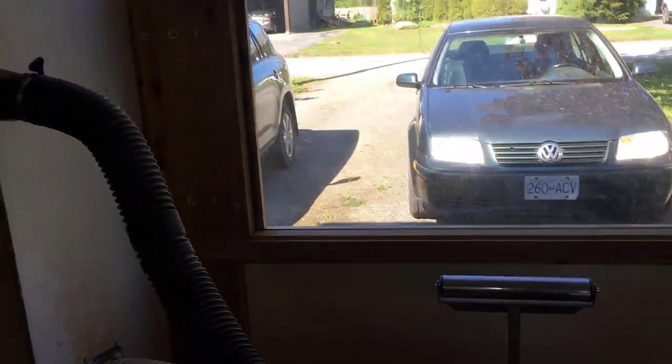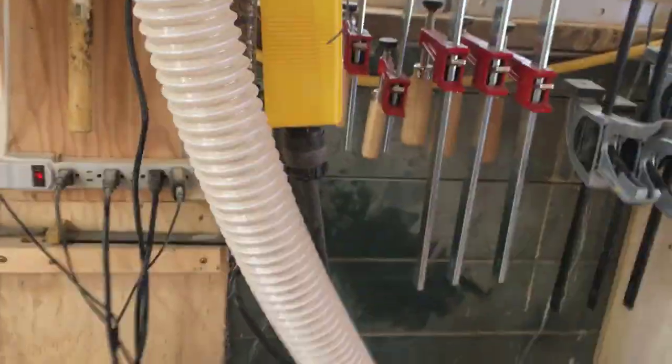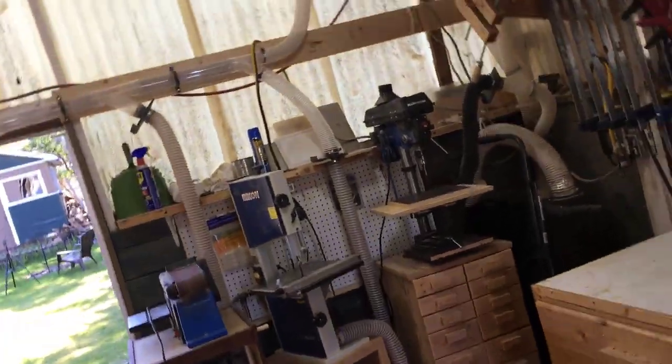The other pipe comes down the side and around the back — that's the other draw for the table saw. There's another pipe from here that I use for my jointer-planer as well, plus a little two-and-a-half inch available to use with the bench. So that's basically the dust collection system: there's a four-inch two-stage system, a four-inch one-stage system, some four-inch reduced to two-and-a-half, and then a two-and-a-half inch network that goes around to various tools that only work with two-and-a-half.